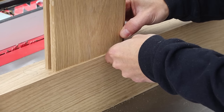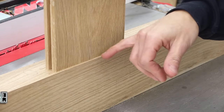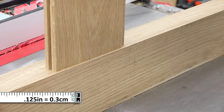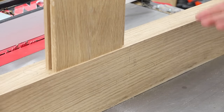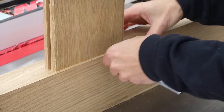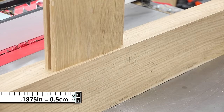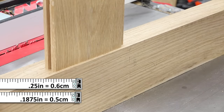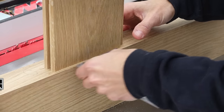All of the other ones with the faux V paneling are set back an eighth of an inch, so it would be like that. I think on this one, because this is actual wood, I don't know why that matters, but because it's actually wood, I'm going to go more like this, I think. That is 3/16 of an inch. I think going to a full quarter might be a little bit too, I don't know.